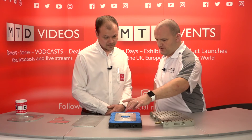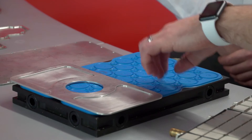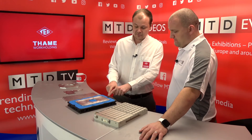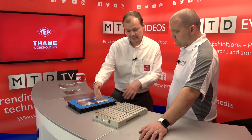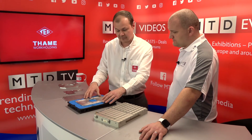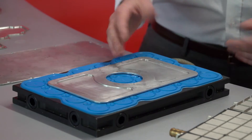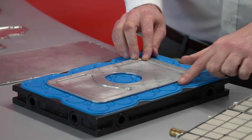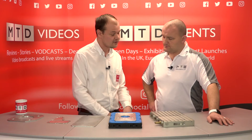How about if we had multiple components — if the part was a bit small and we wanted to load two, could we machine this? Is it machinable? Can we put dowels into the body of the workholding? Absolutely. We would normally recommend getting various parts out of a larger piece. The rule of thumb is that you've got to be covering at least 50% of the mat to generate vacuum on that particular area — any less than that and you're starting to leak air underneath. If you're doing the same part again and again and machining the same pads, you can keep putting those parts on. You don't have to throw away the pad every single time you've got a part off.